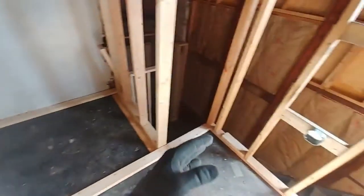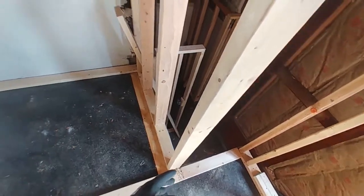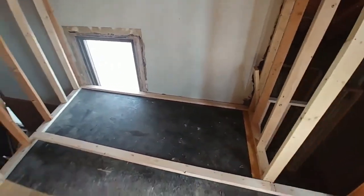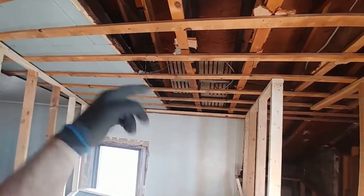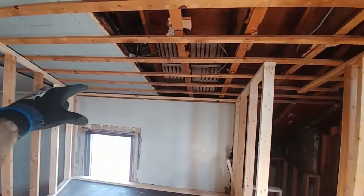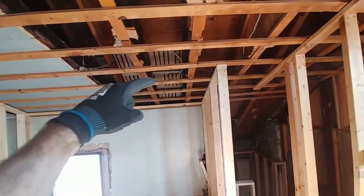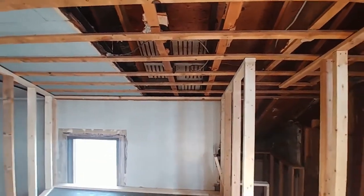And you could say, why don't you just kick this over and make it work out to be a half of an inch from the drywall all the way along there? Let this play out a couple inches differently. Who's going to know? Well, the problem becomes that this wall intersects with the plane of this roof, see? So then all of a sudden, if the wall goes back in that direction another 3 inches, that means it gets shorter the entire way. I'm exaggerating it here, but the wall, where it intersects the ceiling, will be at a slow downward angle. You say, well, that's not that big of a deal.